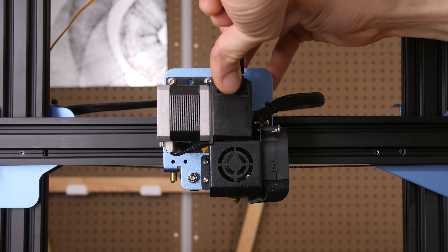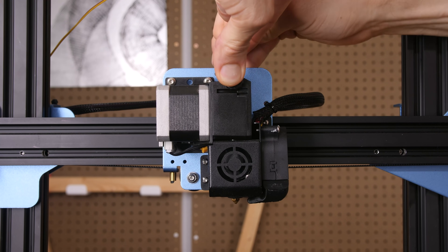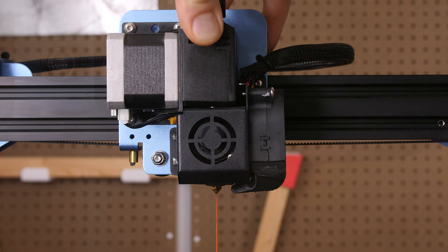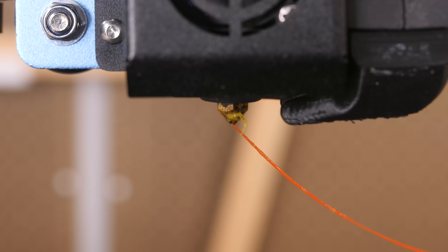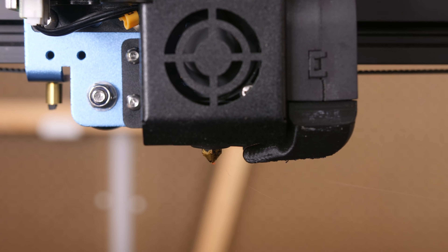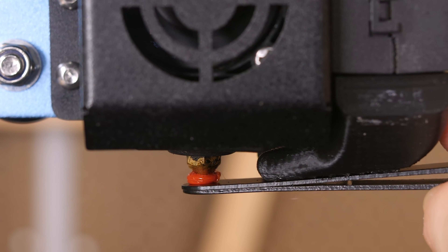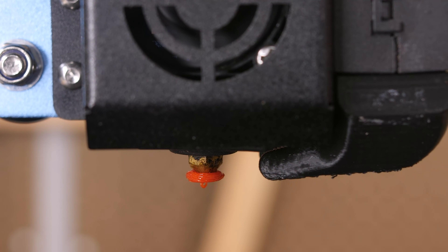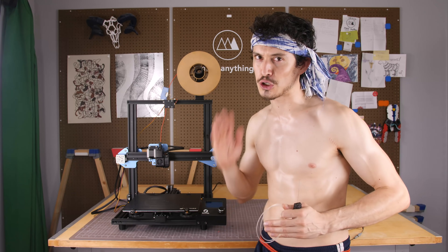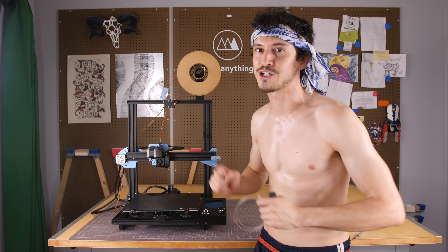In general, when you're removing filament, it's a good idea to push it down a bit before removing it — that way it comes out nice and clean. Then you can start feeding in the next color and extrude until the first color is completely gone. But the problem is there might still be little boogers on the nozzle that get caught on the print later on. A wire brush does a great job of cleaning the nozzle, but my truly lazy solution is to use the back end of my tweezers and smoosh it up against the nozzle. Then I can extrude a blob of filament and push it up against the nozzle, so that when I remove it, if there are any boogers, at least they'll be the right color. It's a great technique for doing quick, clean filament changes, and a tweezer dab like that could even help out with some minor clogs.